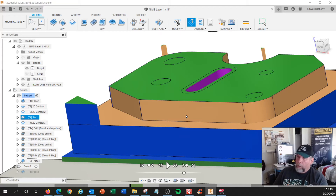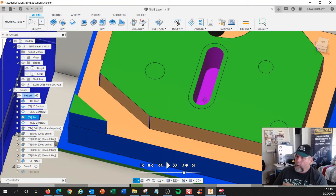Now we're done with roughing. I would use the same end mill and go back in and contour this out at depth. I need to enter without running into this wall, so I'm going to start in the middle again, go to the wall, turn the compensation on, and go in this direction. Remember the end mill is turning this way, and if you're shooting the chips behind you, that's climb milling. If you're shooting the chips in front of you, that's conventional milling, and the finish won't be as good.